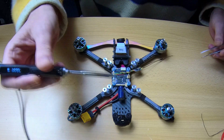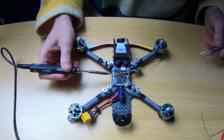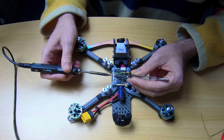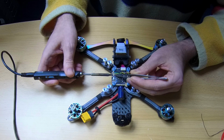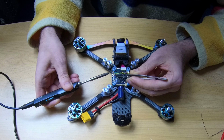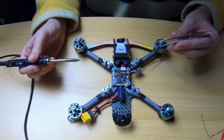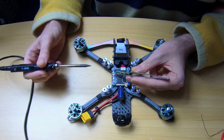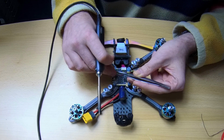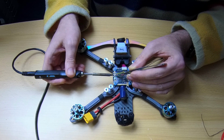Yeah, that looks great. Next one will be, this is my 5-volt over here, so I pick up the 5-volt strand, or the power strand. I press it down on the pad, and presto, that's gorgeous. And the last one will be for our telemetry, my TX2, transmit 2. So I'm going to be using UART 2 for my telemetry. We'll get to that in a second.